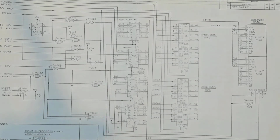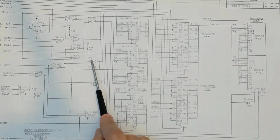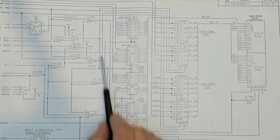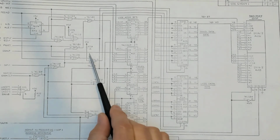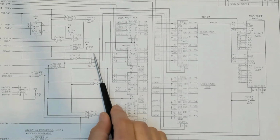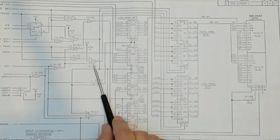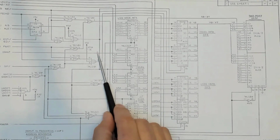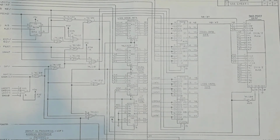And as I understand their comment, they didn't have a problem with any of the multi-emitter discussion that I talked about, but their issue was just about these examples that I happened to pull, and they said that I completely missed the point of the purpose of these resistors. And their claim is that in these Intel examples that I used, the current limiting resistors were not to protect the multi-emitter inputs of these devices, but the resistors were there specifically for testing of the circuit, as part of, with the emphasis on the time of design, design for testing, design for manufacture, and automated test equipment.